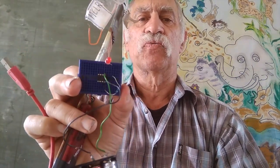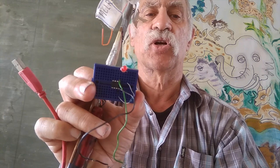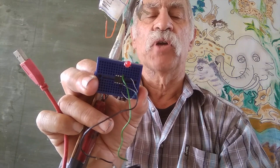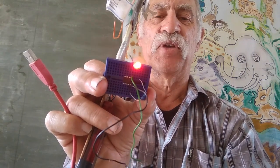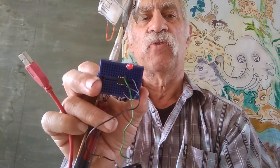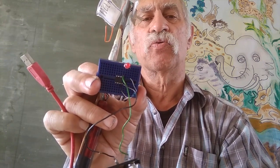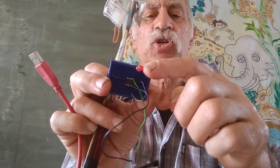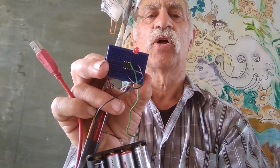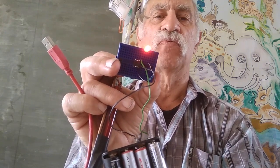The person I'm making this for has a car and doesn't want it stolen, but he wants it to flash a bit faster. I'll show you the program I use on MPLAB and I'm just going to speed it up. We timed it — he wants it to flash 24 times in 10 seconds, which is 0.4 of a second. So the on period must be shorter, and the period between flashes also long — the whole period must be 0.4 seconds.